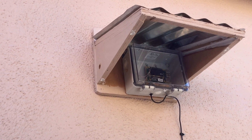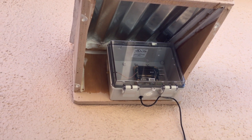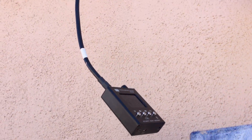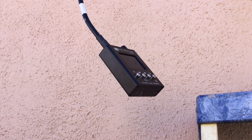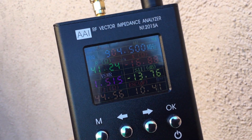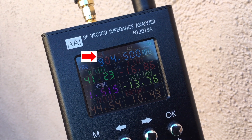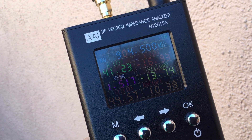I did check the VSWR on my antenna to make sure that wasn't a factor in my test results. It's a little windy, so sorry if the sound isn't that great, but I went ahead and disconnected the antenna from the gateway and hooked up the vector impedance analyzer to the cable connected to the antenna on the roof. I'm interested in knowing if there's any impact from running 35 feet of coax to the gateway. The VSWR is under two, so that's good. I have this currently set up for 904.5 MHz, and when I originally tuned this antenna I had it tuned to about 915 MHz, so all things considered this is looking pretty good.